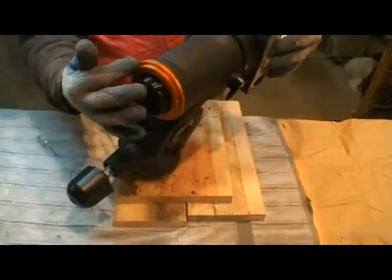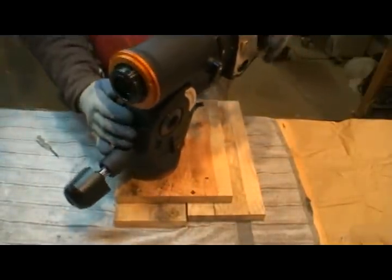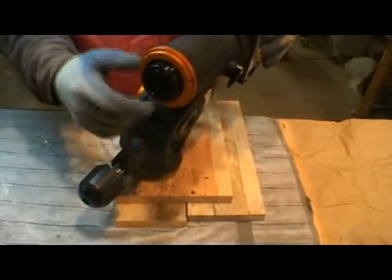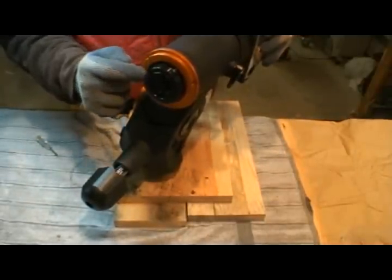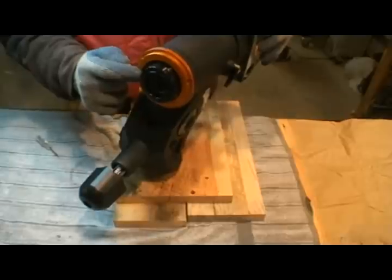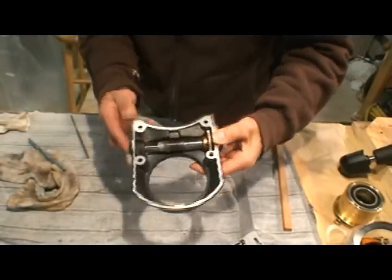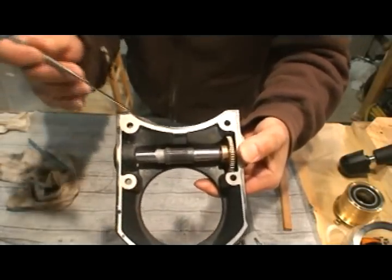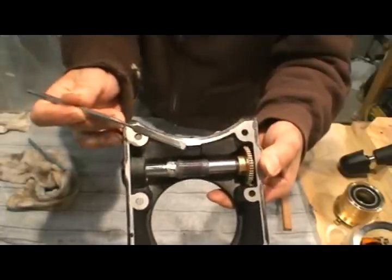The orange collar is held in by three Phillips screws, so we can get it off. It's held in by four set screws that are two millimeter, I believe. This is the Right Ascension housing and this is the worm gear, and as you can see they're using a clear grease.